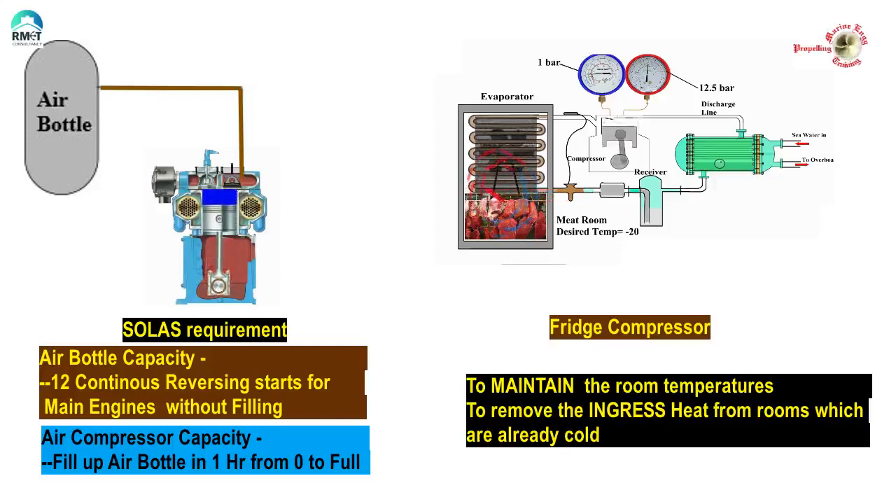We can conclude that at a theoretical level, bumping clearance is very much present in all reciprocating compressors. Whether we measure it or we don't, it has to be there. We should not imagine that fridge compressors do not need bumping clearance.